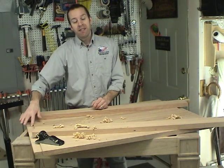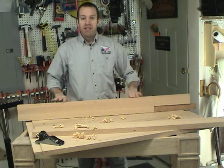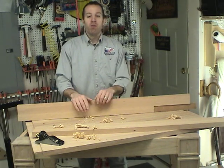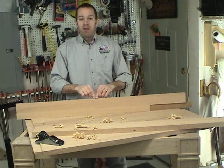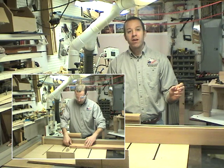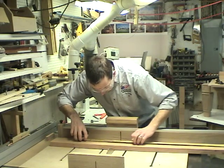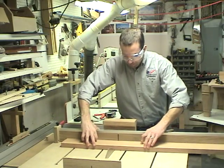With the long tenon shaped on the end of the tabletop, it's time to make the mortise in the breadboard ends. First, I plane this to a thickness just a hair greater than the tabletop thickness itself — that gives me a little room to tweak it after I've got the mortise in. Then it's off to the table saw to cut these to width. Using the crosscut sled, I'll cut the breadboard ends to their final length — slightly bigger than 30 inches — allowing an inch more on either end for a big chamfer. I'll make a square cut and then cut both pieces to length.